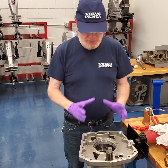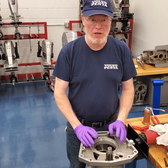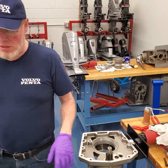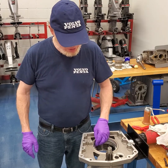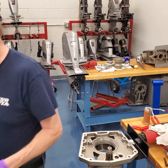Next, we're going to put the vertical shaft back in with the lower gear assembly already assembled. It has the same set of clutches in it as the upper. The book will tell you to put 40 thousandths of shims inside the case here for your initial measurement. And then we're going to put the retainer in, so let's put that back in.